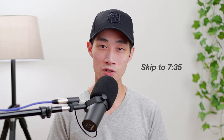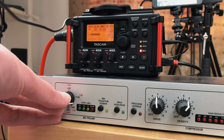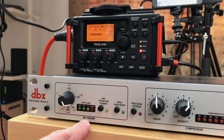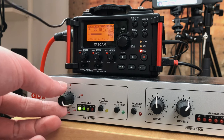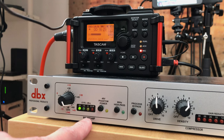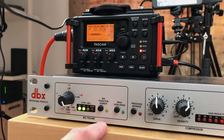Let's start with the left hand side of the DBX. The first dial is the mic preamp gain. We want to set the level as loud as possible to get a good signal into the chain without clipping the audio — if it does, the orange or yellow light will light up. We definitely don't want the red light to come on. For the SM7B I've got the dial all the way maxed out, which provides a nice clean gain. Generally we want to keep it within the first two green LEDs. If you need phantom power it provides 48 volt phantom power, but the SM7B doesn't need it, so don't turn it on.